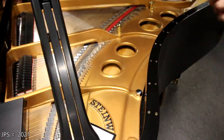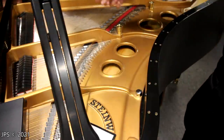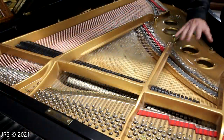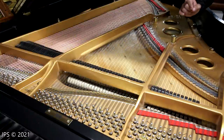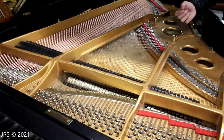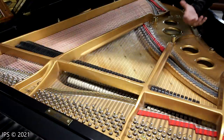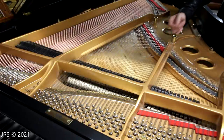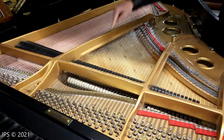And there's actually another really interesting aspect of the climatization of this piano, and that's on the soundboard. Let's go look at that. When looking at the soundboard of this instrument, you may notice little dark blemishes, and at first glance they may look like knot holes, which wouldn't belong on a soundboard, but in fact, if you're on point with the thread here of screws being in places that you normally don't find screws in a piano, you'll immediately recognize that these are screws. So you've got one here, you've got a couple of them here, you've got three here, you've got a row of them over there, and so on and so forth.